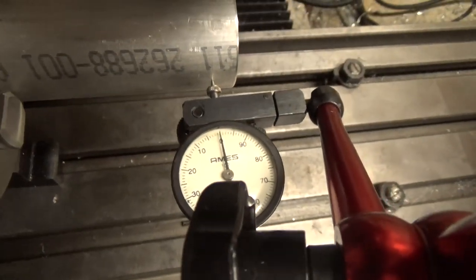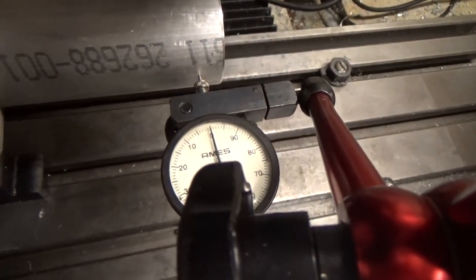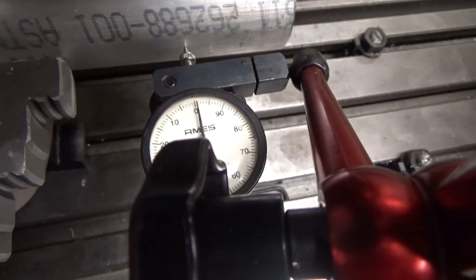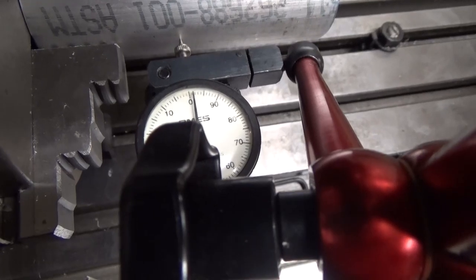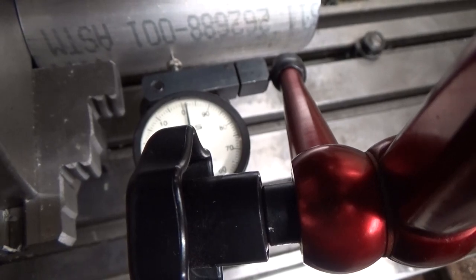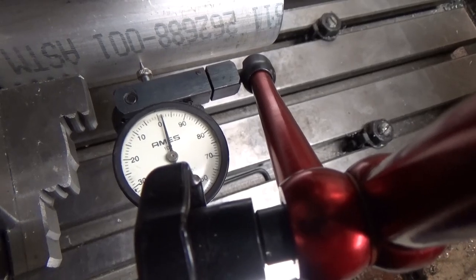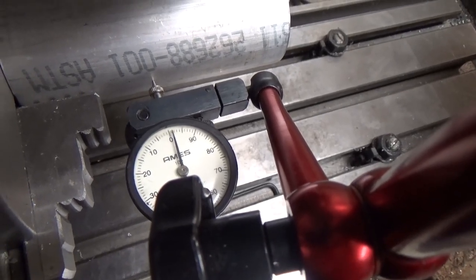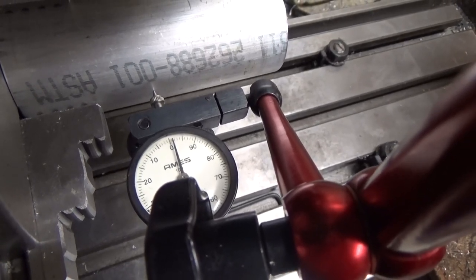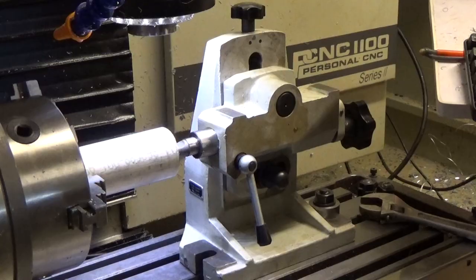I already have it in C and what's gonna happen is I'm gonna move it on X, so if I traverse on X my needle should deflect. There is a little bit of play so I'm gonna knock it slightly to remove that — I believe that's about a thousandth of an inch offset. I'll do that off camera, but you get the idea: you keep doing that until you see your needle at zero as you traverse, otherwise you will be putting an angle on the feature.